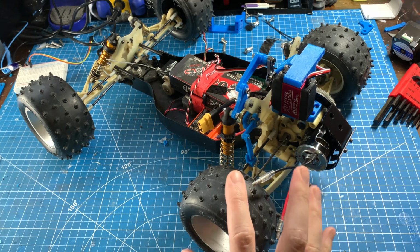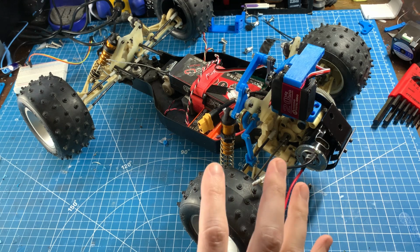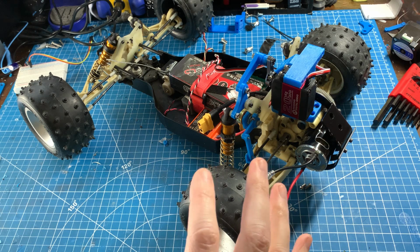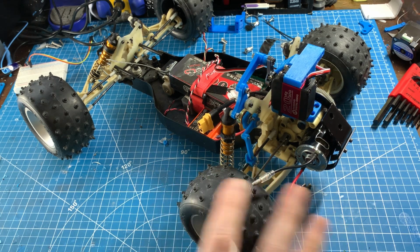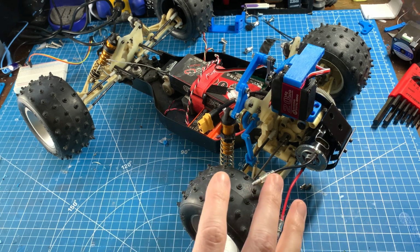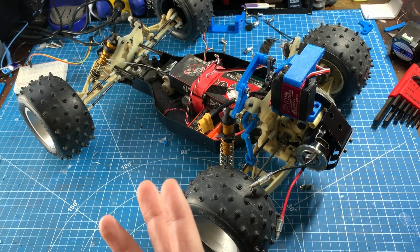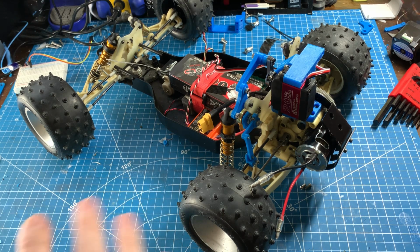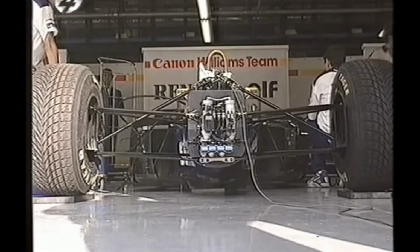So on to active suspensions. Active suspensions can actually add energy to the system, meaning they have an actuator that can actively raise or lower the suspension and actively counteract forces like body roll. For this project, I explored a variety of approaches to creating an active suspension system. I looked at pneumatic active suspensions, but unfortunately these are typically a slower acting type and less precise than other control methods, and primarily used for load leveling in trucks.